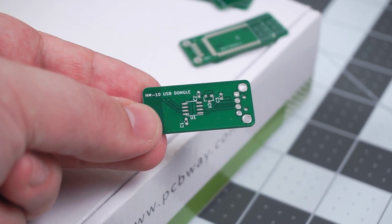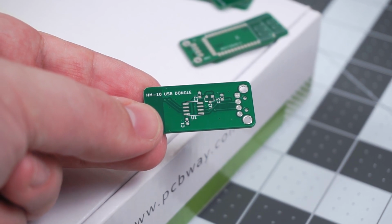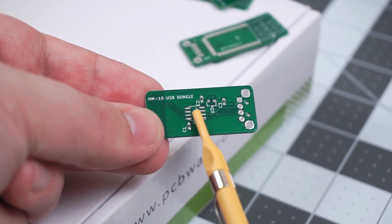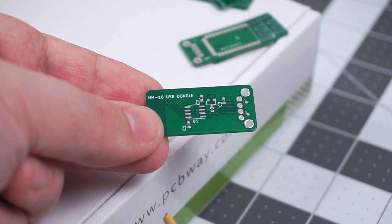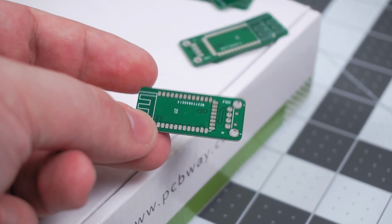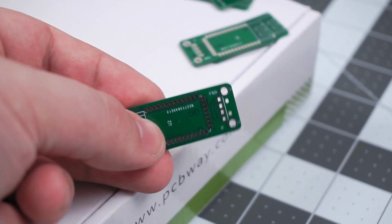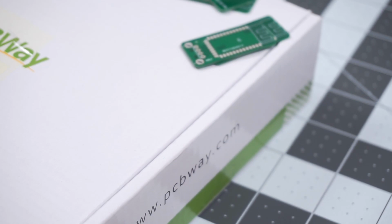I like to use it in my project because it doesn't require extra components, comes in a small 8-pin package, and doesn't have driver issues. At least I haven't encountered any. The extra pins on other USB to serial converters are for flow control and other features which I don't usually need.